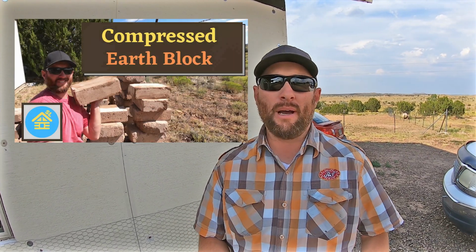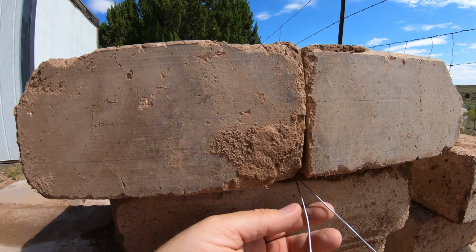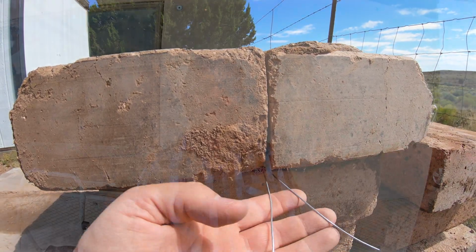I just wanted to do a brief video to show you what we're doing to stucco the walls of our home. If you saw our video about the compressed earth block, where I explained how I laid the block and used the mortar mix, I also showed you some of the things I would have done differently, like putting stucco wire or some kind of galvanized wire through the block in order to attach the stucco wire. Since I didn't do that, I am attaching my wire differently, and I want to show you what I'm doing.